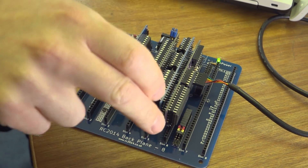How much space does a program take up today — say, what's going on behind you? The program for that is probably 1K, maybe 1.5K. It is very, very small. And then on the right-hand side is the serial adapter there. I've got it connected to an FTDI lead — a USB-to-serial lead. Because it speaks serial, there are so many things out there which also speak serial, like Arduinos, like Raspberry Pis. It's the universal language, so anything with a serial port can connect in and control it. It is very easy to get into — as long as you know which end of a soldering iron to hold, you can build one of these.